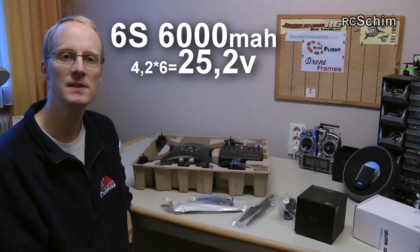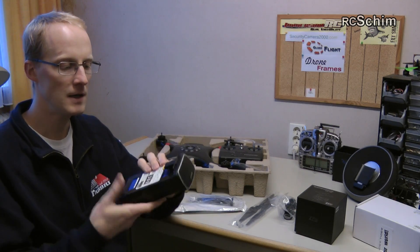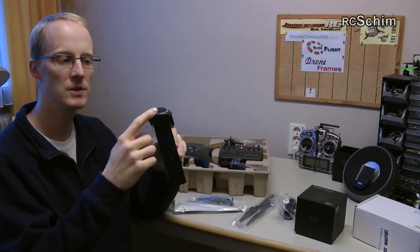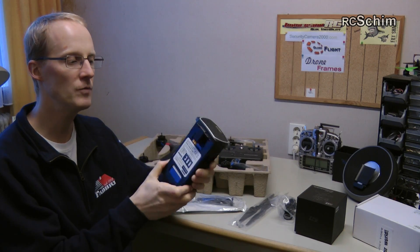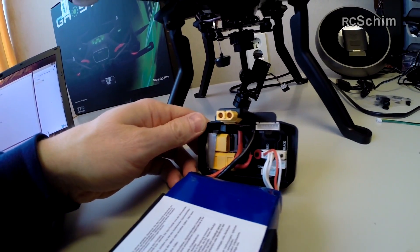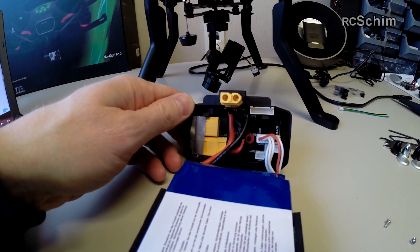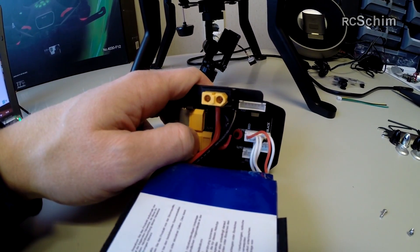So we have a 6-cell battery, 5000 milliamp, in a custom case. You don't have to buy their batteries all the time — you can just buy another plastic frame and insert your choice of batteries in there. And this is how they cable the standard battery supply. All nice XT60 plugs, and it's even prepared for two 3S batteries in series to get more voltage.